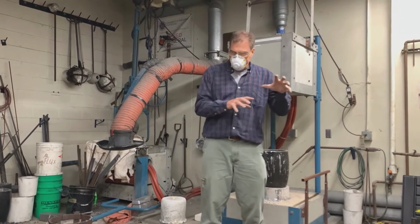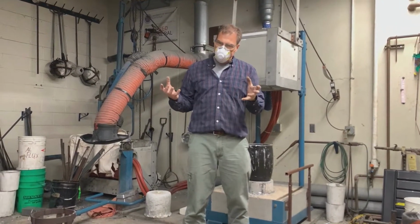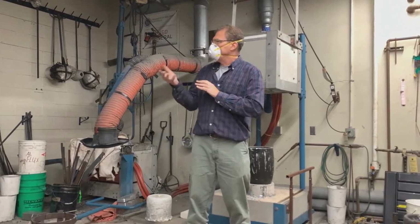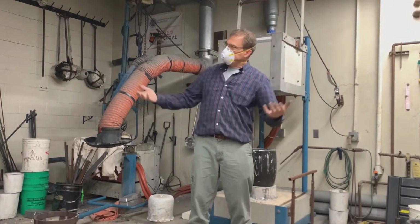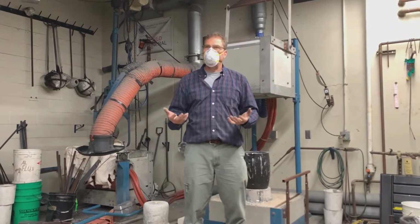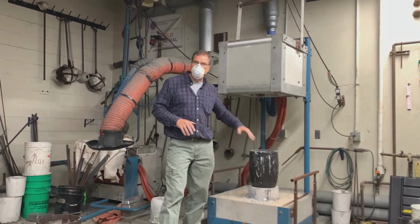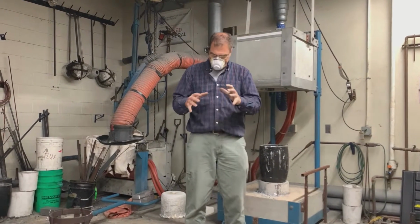which is electrons moving around, right? So they're currents, but they're being forced in random directions to some extent. And eventually, that heats the metal up, because when you have conduction, it creates heat, especially when there's a lot of current. It gets hotter, which increases the resistance. It gets hotter, increases the resistance. Eventually, it melts. If you've ever looked in this furnace, when you have molten metal in there, it actually mounds up the metal a little bit, like a little bubble.